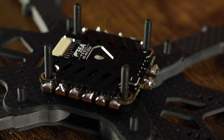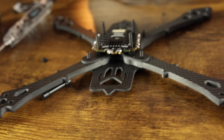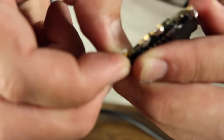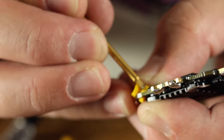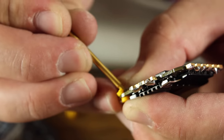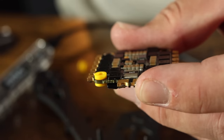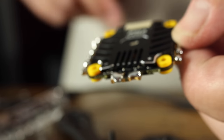In the bag of hardware from the stack, we've got the little gummies — the rubber grommets for the ESC. Be careful if you already soldered to it because it will be hot. Take one of your drivers and shove one side in, being careful around components close to these holes. We'll go all the way around and put all four in.